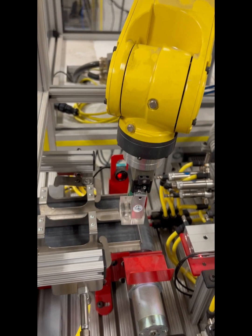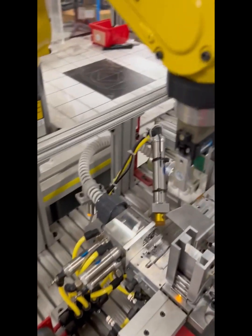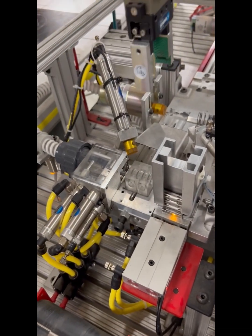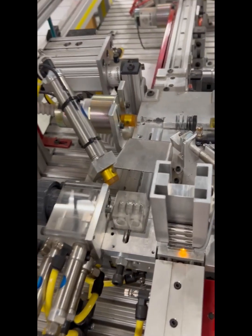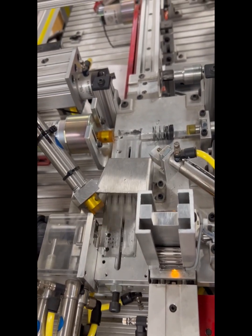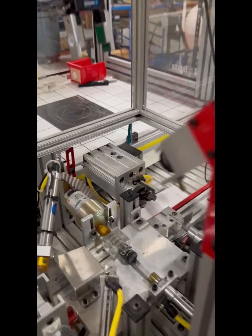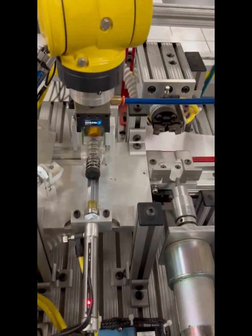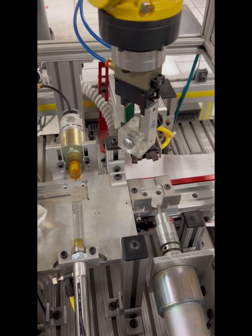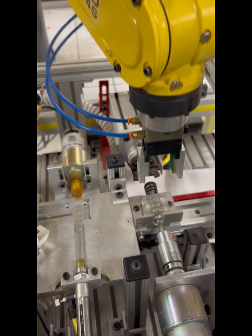If there is a knob waiting, it'll tell the robot to grab a part from a previous station and put it on the assembly platform where one of the two types of spools is inserted, and a bolt is inserted into the spool. Once that's completed, the assembly is slid down a little bit further to where the bolt is started onto the knob. Once the threads are started, the robot picks it up again and places it onto the next station.